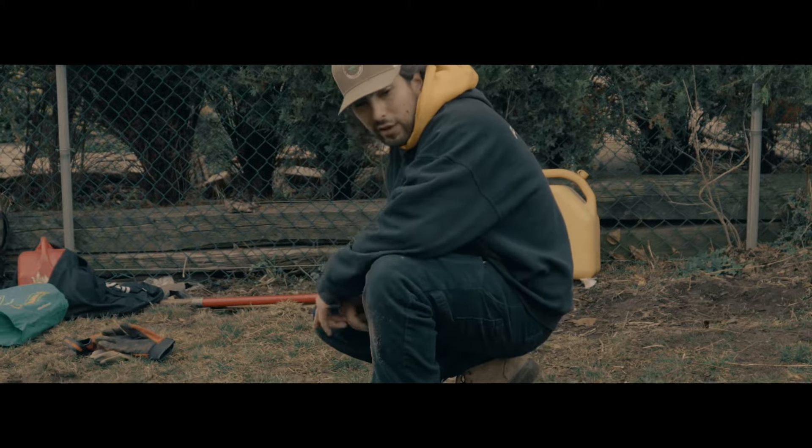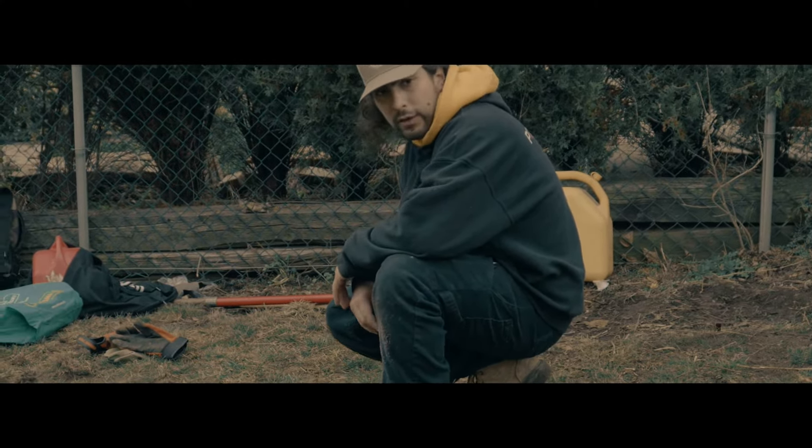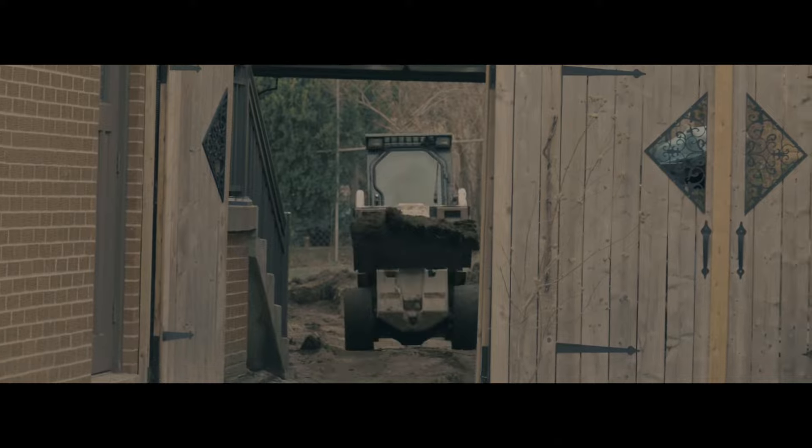We are four inches here, so we have to excavate 13 inches down. I'm going to keep excavating while they load the bin, then I'm going to go make the dump run and get a grease gun while they excavate this by hand.